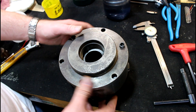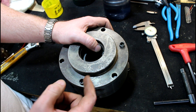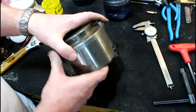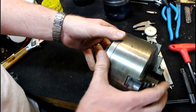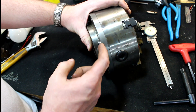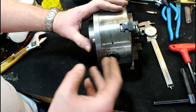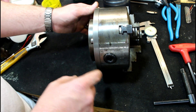All right, there we are — finally got the back plate put on. If you noticed, I didn't chamfer these; I didn't really see a reason. I could have done it in the back, but no big deal. That super indexer made pretty quick work of this thing, which is kind of cool, other than I had to switch my tooling up quite a bit. It turned out really good; I'm pretty happy with it. Now I've got my scroll four-jaw — I got to clean it up a little bit. I'm not happy about this: these guys are sticking out a little bit, and I did countersink them about three-hundred thousandths, but I didn't want to go too deep because I don't have much plate left after I initially cut it and then cut it back one more time.